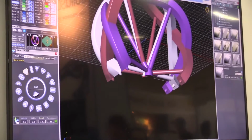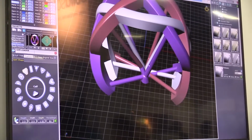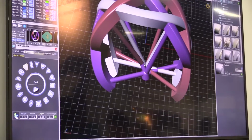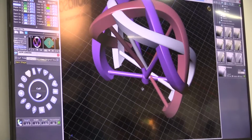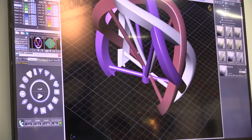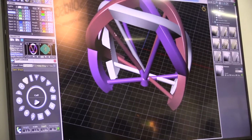And again with this one, these support bars, which are also sprues, I leave those in place because if this thing turns a little bit while we're cleaning it, filing it, setting any stones, we're definitely going to lose our key fit. So support, support, support. Keep them in there. Maybe Hagop can talk a little bit about how we did the assembly on this.